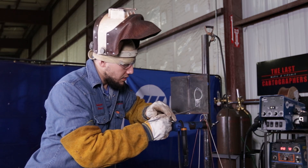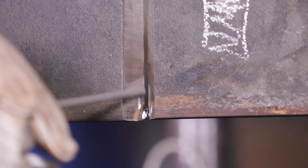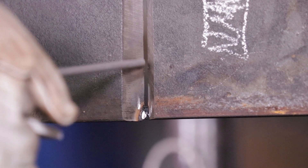So you push into it, down, push into it, down — push in, go back down, push in, go back down. Actually when you go up, you have to push into the plate because you've got to choke the rod to stop heat. Alright guys, let's get to it. I'm going to start the root pass.